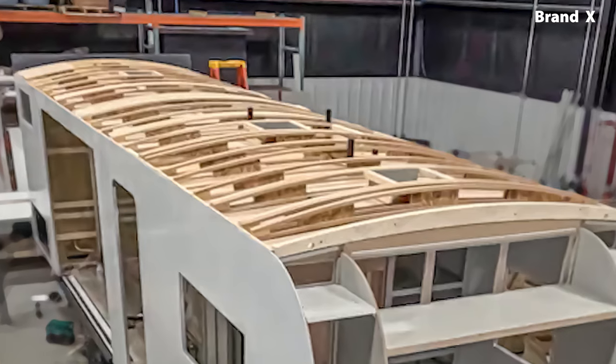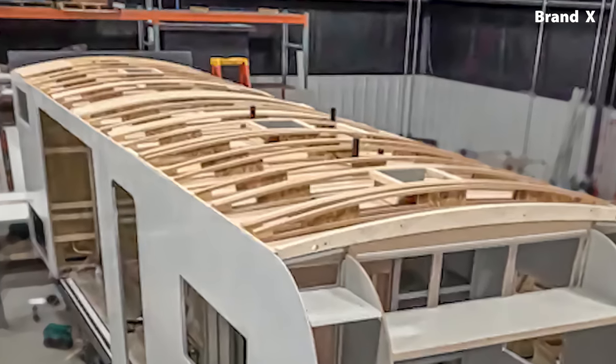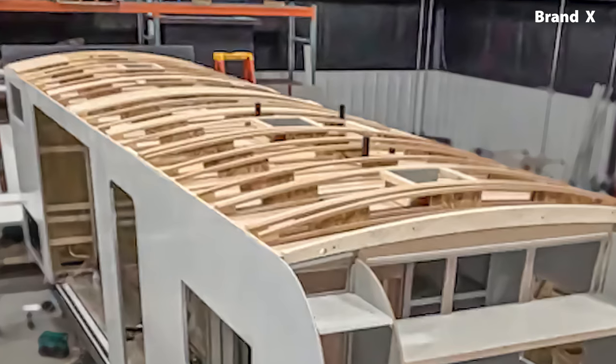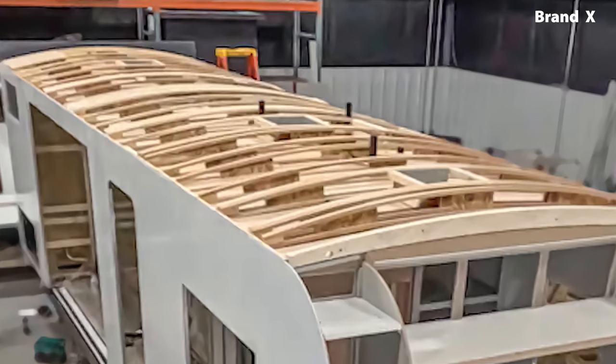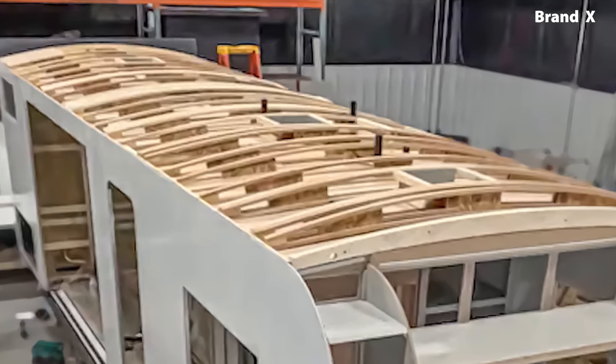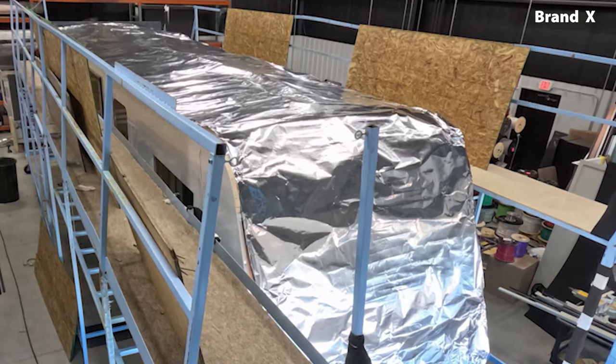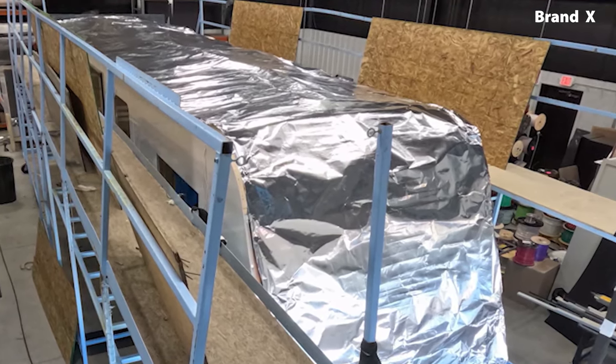Examining the truss heights in the roof, it is clear that there isn't sufficient dead air space to justify the R values claimed by some industry figures. It is advisable to check the R value attributed to each layer according to manufacturer claims. A radiant barrier without an insulated bubble layer does not possess an R value.